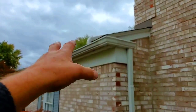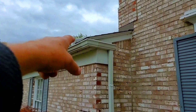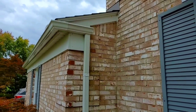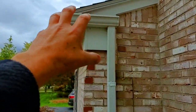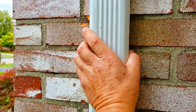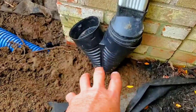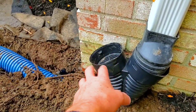When radiant energy melts snow on rooftops, it could be 20 degrees out, it could be 18 degrees out. I've seen melt off of roofs when it's 10 degrees out. So this is all being hit by direct sun, known as radiant energy. The air is below freezing. So the gutters start to build up and ice up. Anything that turns to liquid and hits this at an 18 degree temperature, 10 degree temperature, 25 degree temperature, doesn't matter, freezes. So if you end up with an ice blockage down here, when it thaws, it can escape